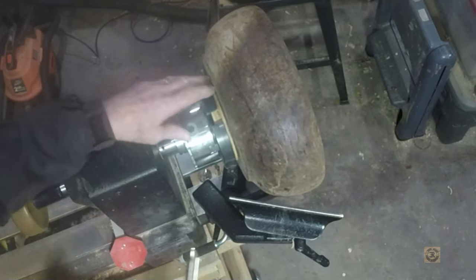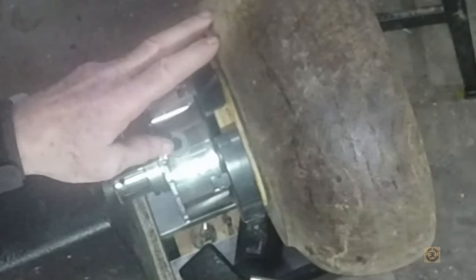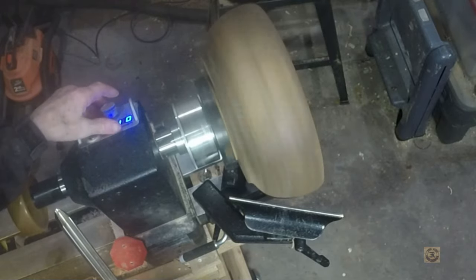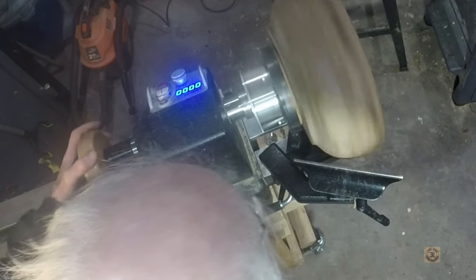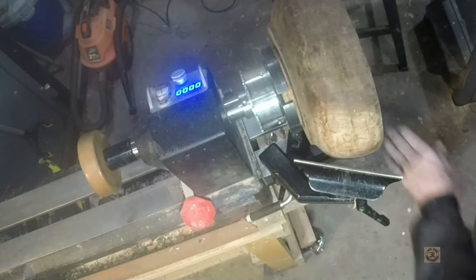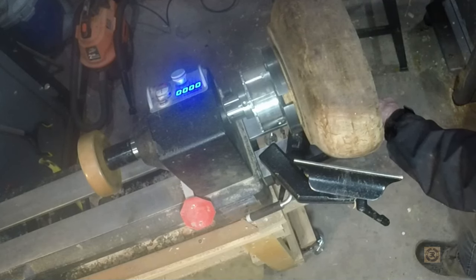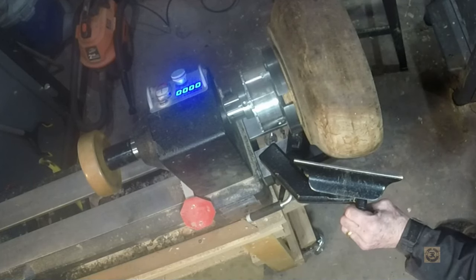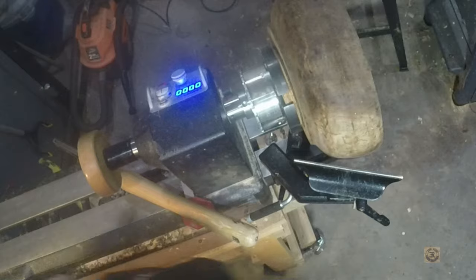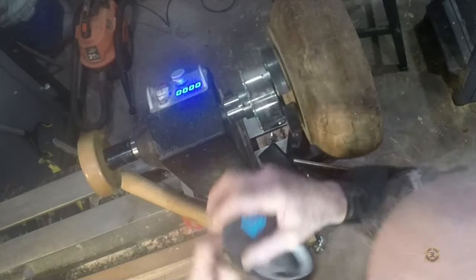I think I'll start with the 3/4. This is an extremely wide foot. I'm going to bring that in some. Right around 600 RPM. This thing is 15 inches across, and 600 RPM is all you want for a 15 inch bowl using the 9000 rule. I will have to wear a mask. This is very dry, it's going to be dusty. Opportunity to wear my new RZ mask.